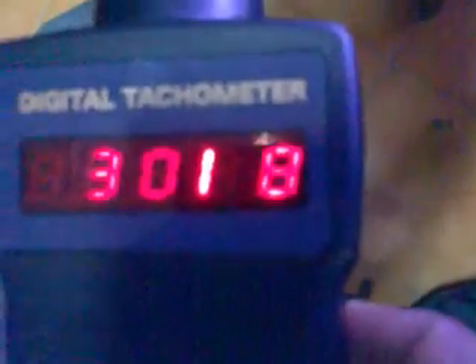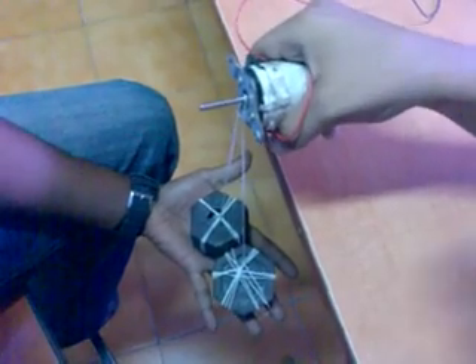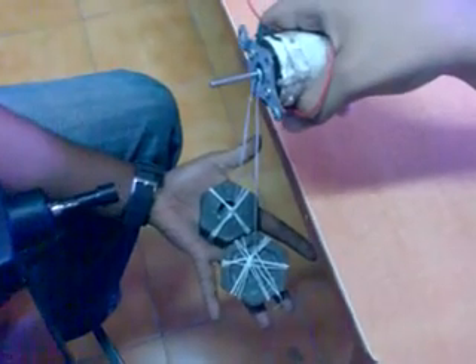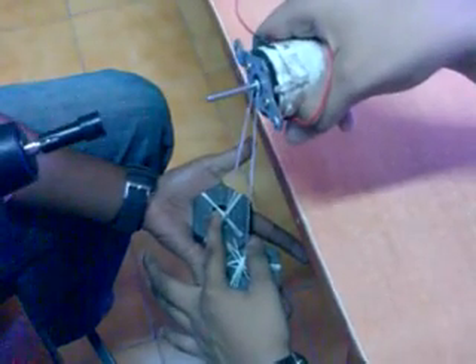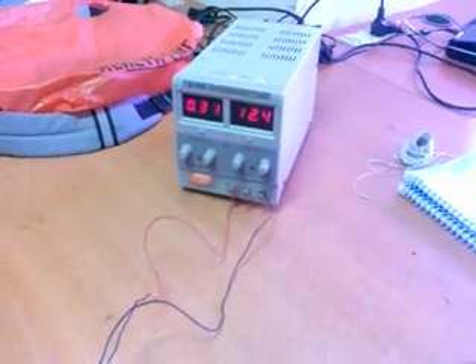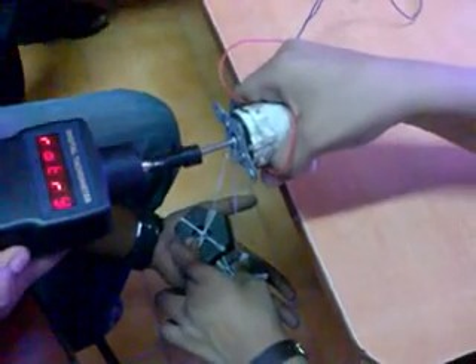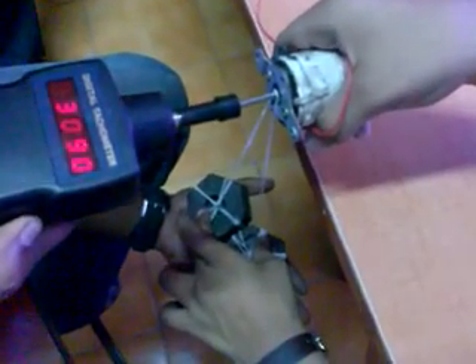Now we are going to try it out under load. The load is applied on the basis of two things: the load applied from the bottom, and the load totally depending upon the shaft. First, we are holding the load such that the motor doesn't get overloaded. Again, the 12V DC supply has been given. Now, when the motor has started rotating, the RPM reading is being calculated when the load is not yet activated onto the system. The RPM rating can be seen nearing 3200 with less pressure being applied onto the shaft.